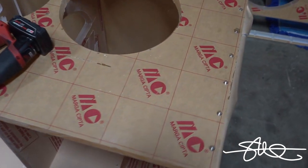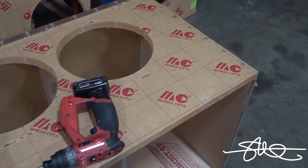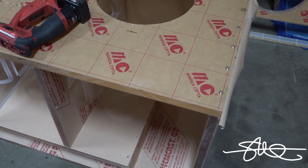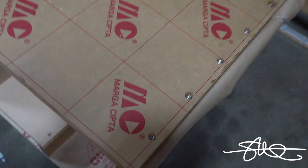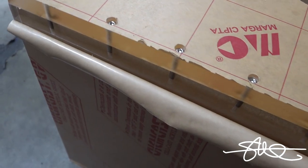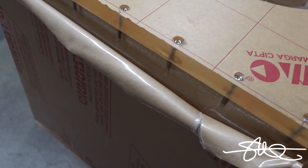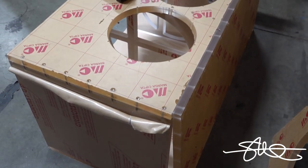Already put together a couple rows of these just to make sure that it was gonna work, but I just had to make sure it worked before I continued filming. So I do have a lot of this put together still. As you can see, we're countersunk. Quarter by 20, inch and a half long, countersunk. Pretty deep into that 1-inch acrylic. Time to get busy.